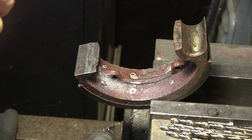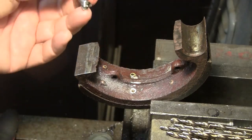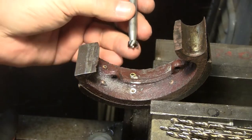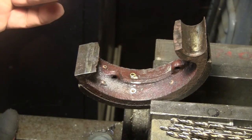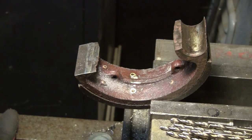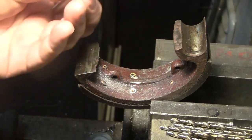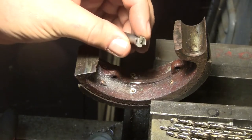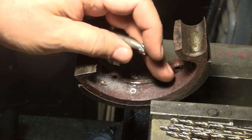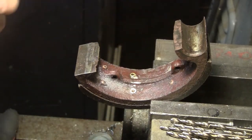I'll try to put a link in the description if I don't forget, and then you can see what he did. He's obviously done a million of them. But this Forstner bit is 3/8, which is supposedly the same size as the head, but it comes out just a shade bigger, and it worked really good. I really like this bit. It's got a pin in the center, so once you drill a hole through the lining, it'll self-guide down that little tiny pilot hole that you drill.